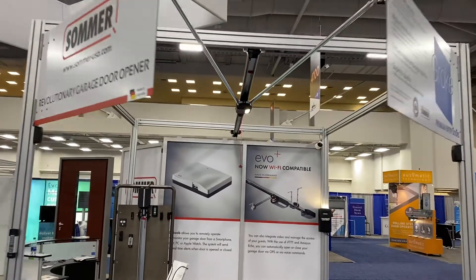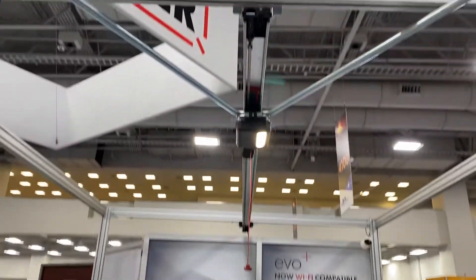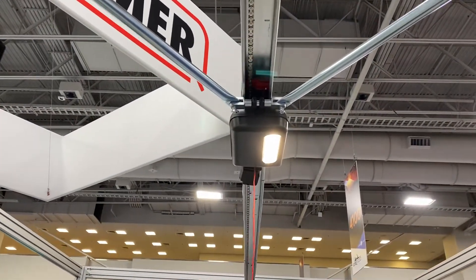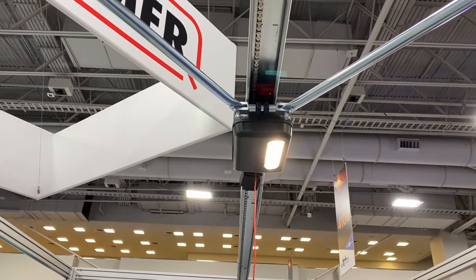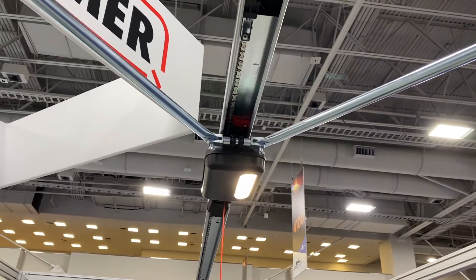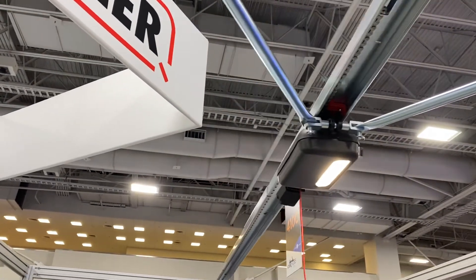This model is a Pro Plus 2060 and you can see how the motor carriage is. With the swing door open, it's close to the wall; with an overhead door open, it's farther away from the wall. That means the motor actually has to be reversed in order for the safety sensors to work in the right direction.